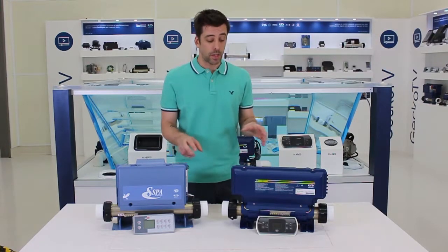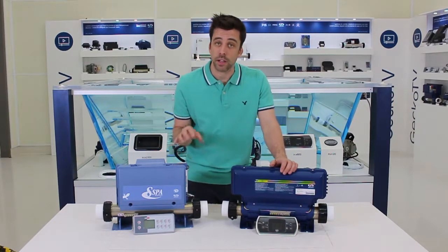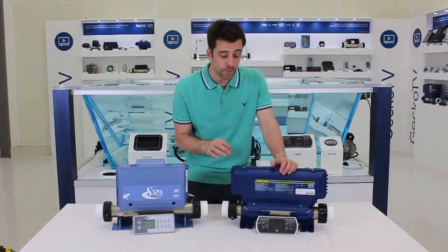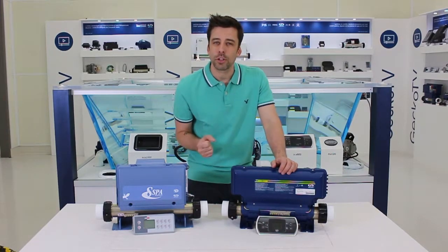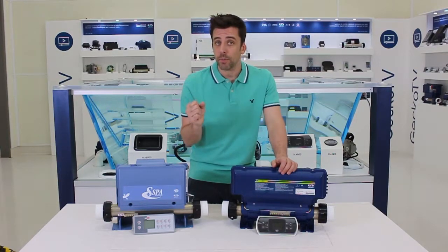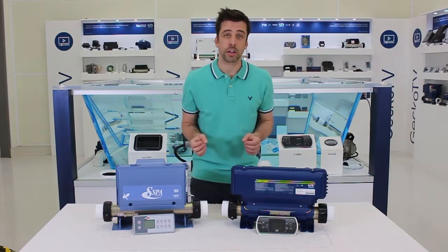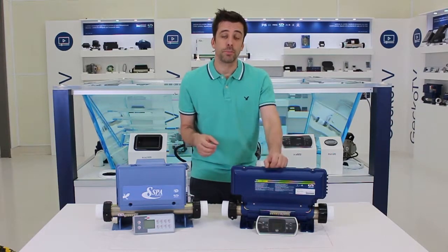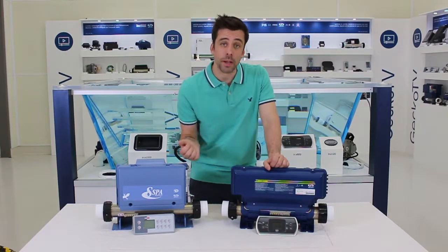And ultimately, if it's all correct, all set properly, and you're sure about your programming and your hookups, and it's still not reacting when you press the key on the keypad, it could be as simple as a defective keypad. Reset your breaker, and if the accessory starts when everything is starting up as well, it could be that your keypad has a defective button — so a keypad to replace.